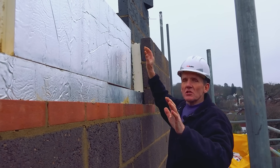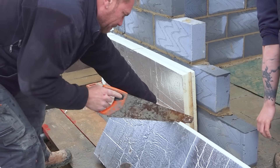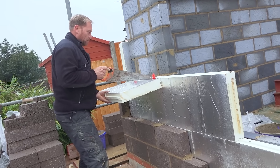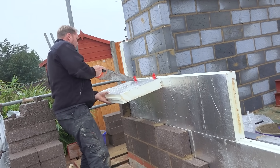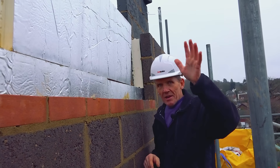Very, very important, but as I say there are lots of ways of doing this. It is a bit demanding — Mark was cursing it a little bit because you've got to maintain that 10mm gap all the way along to get it in, pushing and pulling. But the reward is that you get a much higher level of insulation.